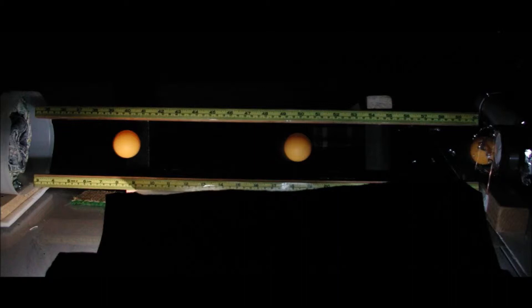Here's one more similar image for the triple flashes where we tried to reduce the glare but also get a little bit of a ruler. And here's a similar thing with triple flashes again — half-millisecond or 500-microsecond spacing — this time hitting a piece of hardy plank. The right-hand image shows the ball breaking out of the final vacuum membrane, the middle one shows it just hitting the hardy plank half a millisecond later, and then the final flash shows bits of the hardy plank breaking out the far side. You can see bits of the ball bouncing back. All of these made clean holes through the hardy plank even though some bits of the ping-pong ball bounced back.